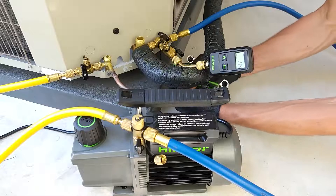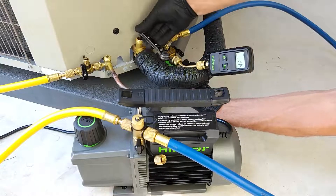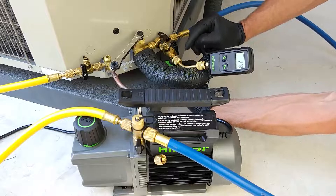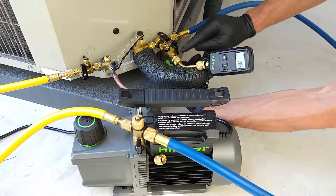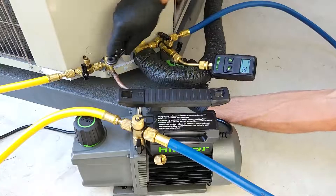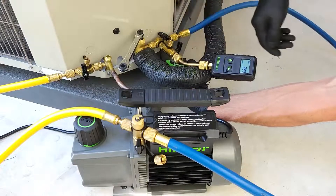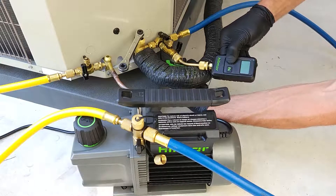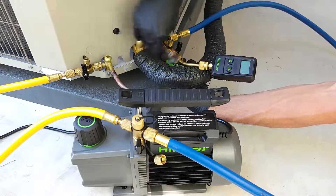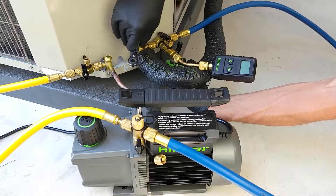What I'm going to do is hold my vapor surface valve with my wrench and open the suction line first. Before I do that, I'm going to turn this valve to the off position. If you see any change in the micron level, just realize that you're changing the amount of room inside that tube. I'm trying to protect the vacuum gauge from any oil that could go up in there and contaminate the sensor. We can just turn that off now — we have positive pressure in the system. When you come up, you don't come up all the way. There is no back seat with these service valves, so once it gets harder to turn, you just stop — there's only a little o-ring inside, not a back seat position.